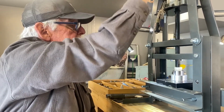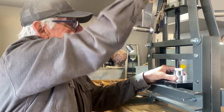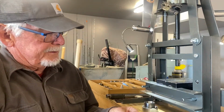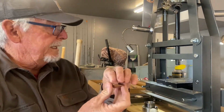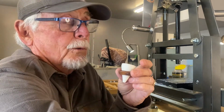Vietnam Veteran coin ring. You can feel it starting to get a little bit work hardened. It's starting to get a little bit work hardened now, so stop right there. And I'm gonna go anneal it again. So now you see it starting to shape into a ring a little bit. I'm gonna anneal it, come back and keep folding it down until I get it folded right up against that cone, and then I'll bring you back in and we'll go on to the next step.